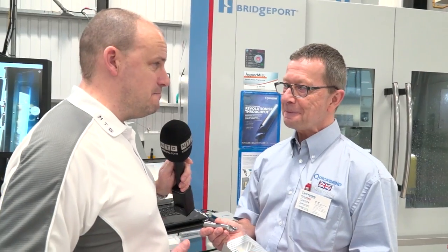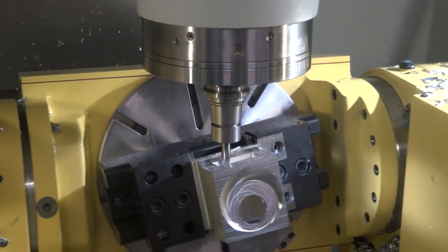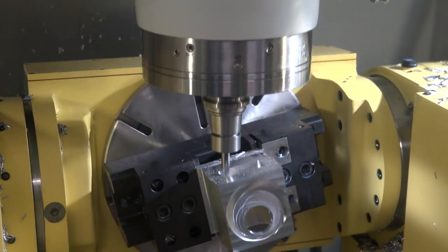I've witnessed some massive cycle time savings, but engineers do like to buy tools from standard products because they can sometimes cost less, and they don't like to invest in things that might cost more money without knowing they're going to get a result. So is this going to cost them more money as an outlay? To us it's just a tool — we make it to our design but to machine your features, so it's not any more expensive. It's actually more expensive if you don't use the right tool for the job. There will always be a need for standard tooling — that's fine as a quick go-to tool — but ideally we produce a tool whether it's an end mill with a shorter flute length, different rads, different geometry to suit the job, and it's not that much more expensive.